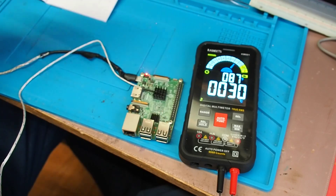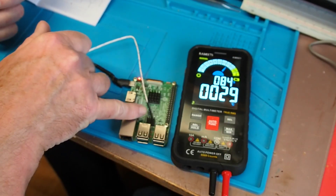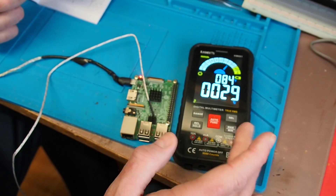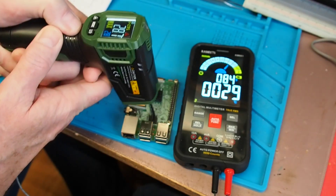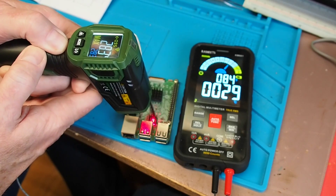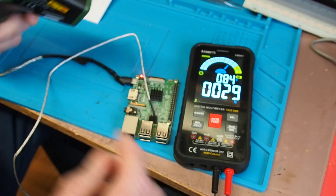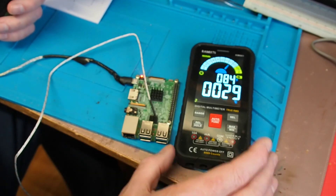The second chip is coming out at about 30 degrees on the infrared thermometer. Moving the thermocouple over to that chip, it appears to be in better contact. The KM601 has stabilized at about 29 degrees and hasn't moved for several minutes. The infrared thermometer is reading about 28.3, with 29-point-something briefly - so quite close. It certainly measures something similar, confirming a reasonable correlation between the two methods.